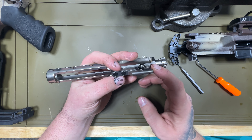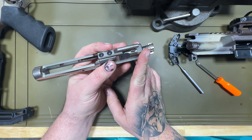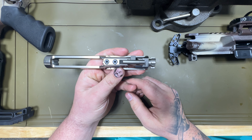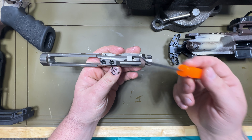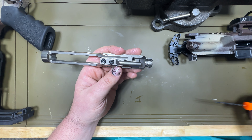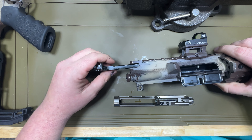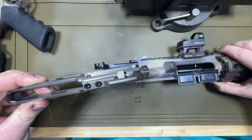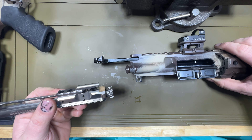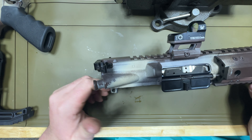When you go to put this back in — if you're new to ARs and watching this video for insight — have your bolt face be out. The reason why: when you go to put your bolt in with excessive overhang it will hit the side of the upper and not allow it to go in. For example: charging handle in first, I have it standing off, go to put it in — can't. Pull the bolt face out — in like butter, baby.